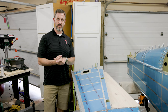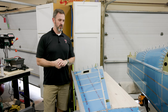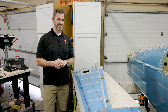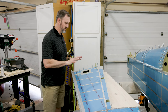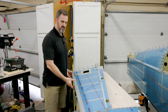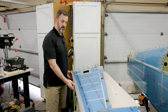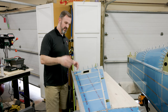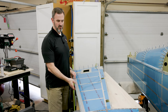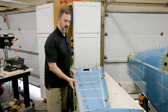It went a little easier than I thought. Fortunately I had the help of a friend, which made a big difference — although I probably could have done it alone, it just would have been messier and taken longer. Now the two halves are together and we've riveted the trailing edge really tightly. I have these angle aluminum pieces from Home Depot with holes drilled for each point on the trailing edge to keep it straight — the same setup I used on the elevators.